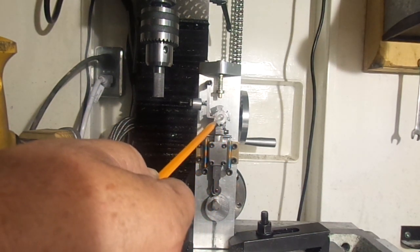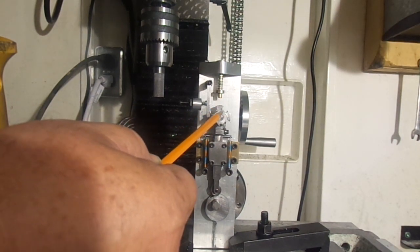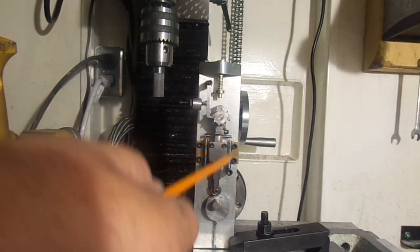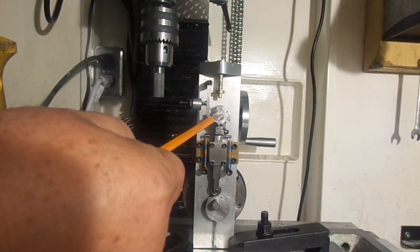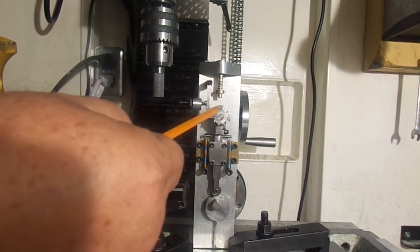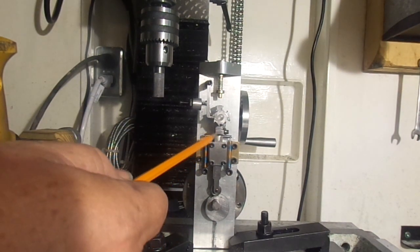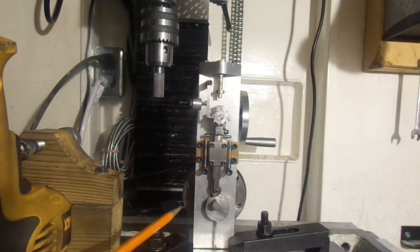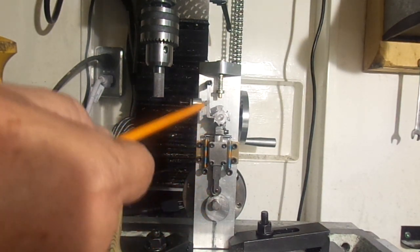The ratchet wheel will advance the mechanism 45 degrees and it won't lift the valve. The next revolution we get another 45 degrees of revolution at the ratchet wheel and it will lift the valve. Now I've seen 3 or 4 different ways of making this same mechanism, and this is about the shortest configuration here.